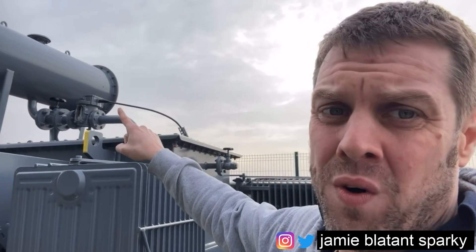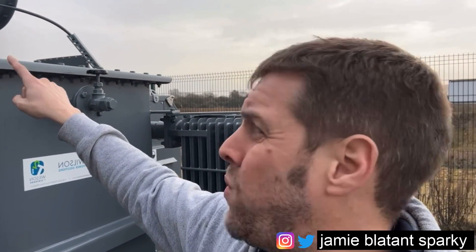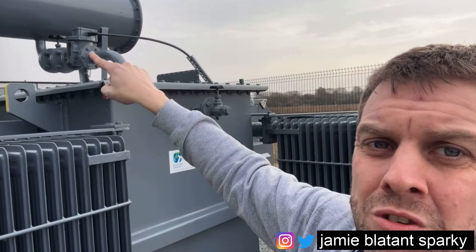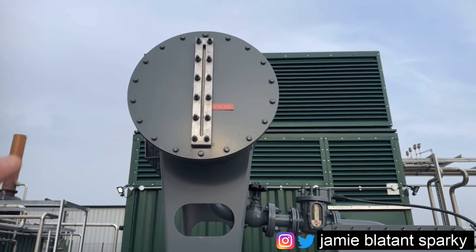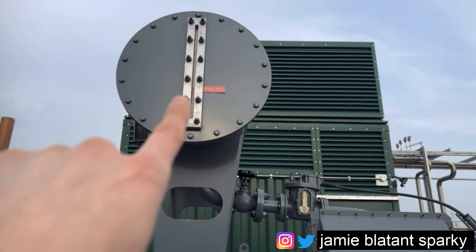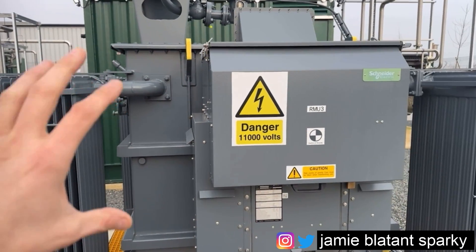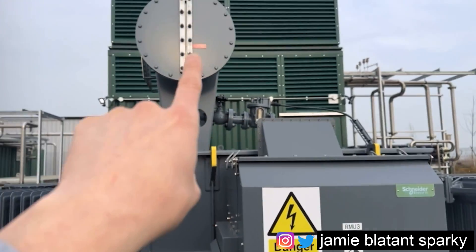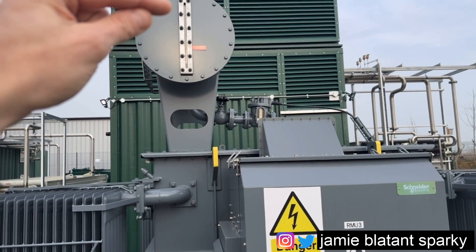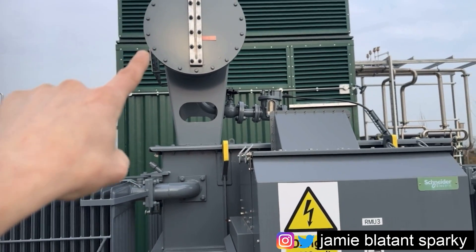That transformer is full of oil and has a breather - that's how that one works. This transformer has a tank on top called a conservator, which is full of oil, as is that pipe and the transformer itself. So effectively this transformer is brim to the top with oil, then there's oil in that pipe, oil through that Buchholz relay box up there, and then the conservator has oil in it. The oil level shows it's up to that level at 15 degrees as indicated by the label. Because the transformer is so big, when it gets hot and the oil expands it's too big to hold it within itself, so the oil pushes up that pipe and into the conservator.